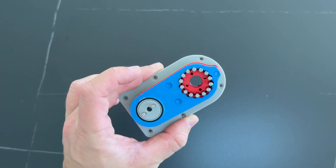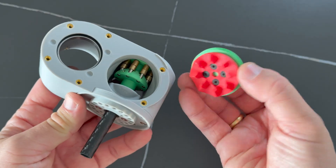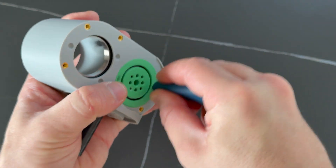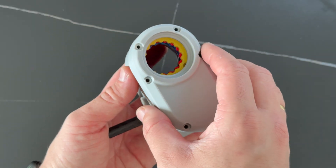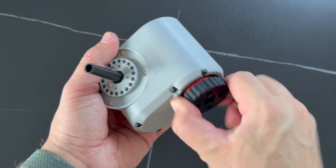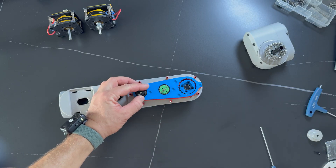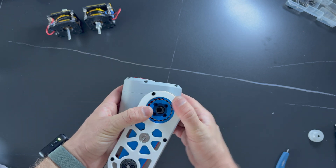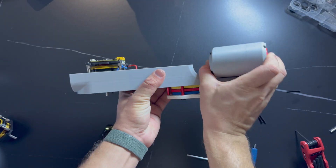This little guy has a 14-to-1 ratio and I use it in a wrist assembly prototype along with an angular roller pinion drive from my last video. I'm really proud of how this preloading screw turned out. For the pitch axis I'm using an 18-to-1 double eccentric shaft gearbox. With the belt drive the total ratio is 45-to-1 for the pitch axis and 42-to-1 for the roll.